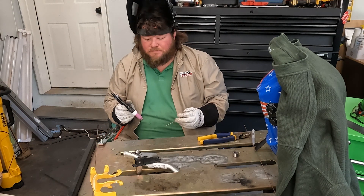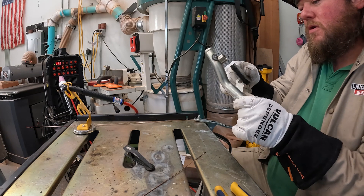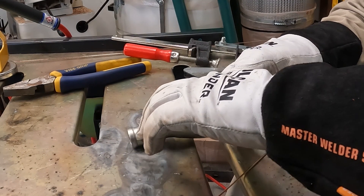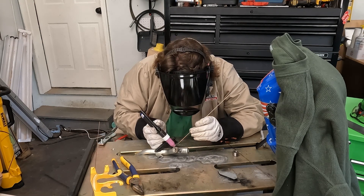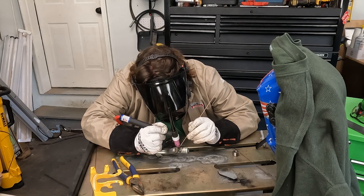We're going to tack it in place. Now I'm going to go ahead and take a look at it and see if I'm happy with it. The next step is to do a bead right along this bottom edge here and see if I can get some thickness and fill that in a little bit so that I can bring the two of them together. Essentially I'm adding filler onto the pipe itself — I'm not actually trying to bridge the gap at this point, I'm just trying to add filler to make it thicker. That'll allow me to bridge the gap a lot easier later because the gap will be much smaller.